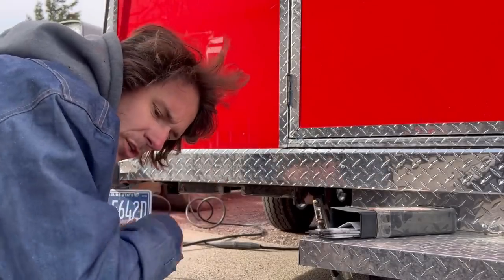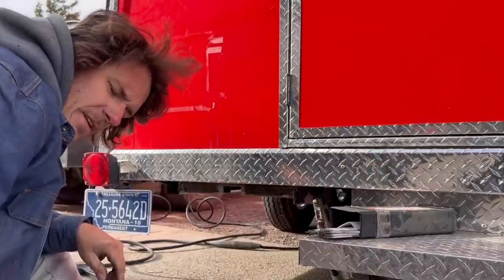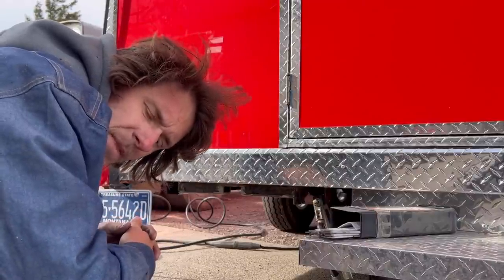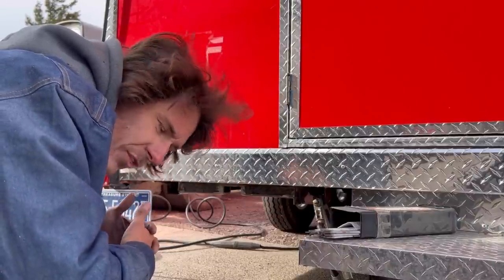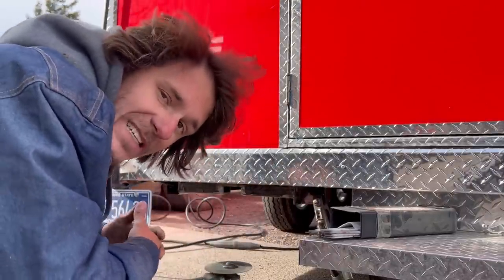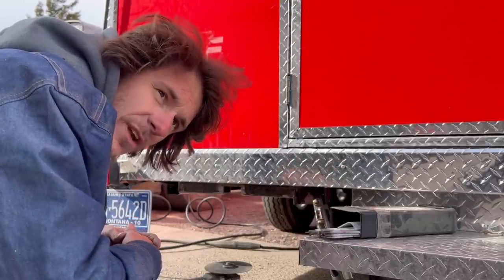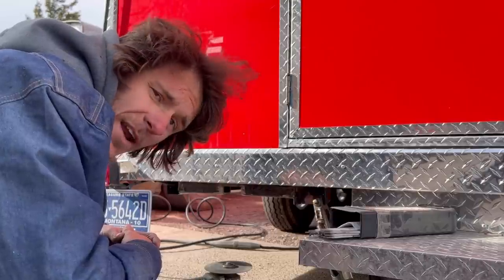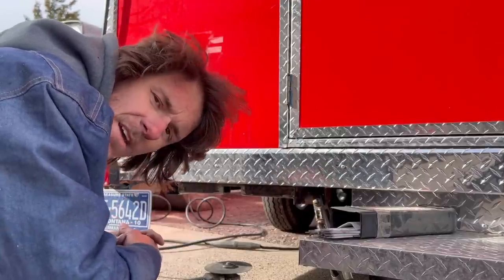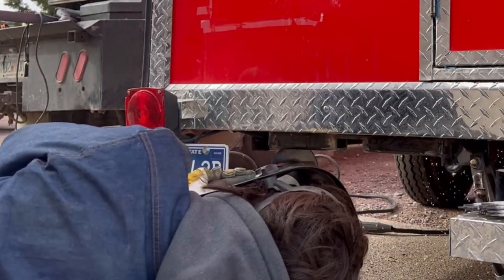I've come up with what I'm going to do as my solution. I could level this out, do a full pen weld, and weld the cut piece back and attempt to cut another piece from underneath there, but I think that's going to be more time consuming and more difficult. So what I've opted to do is go ahead and just cut the piece that I just spent all that time welding out. That's the way it goes — you make a mistake, you've got to correct it. I can't rig this and do some half-ass job; it's got to be done right. So I put the notch to hold the receiver too close to the door.